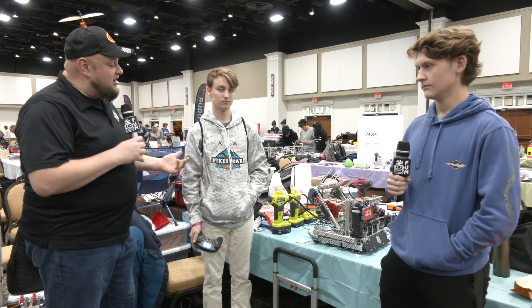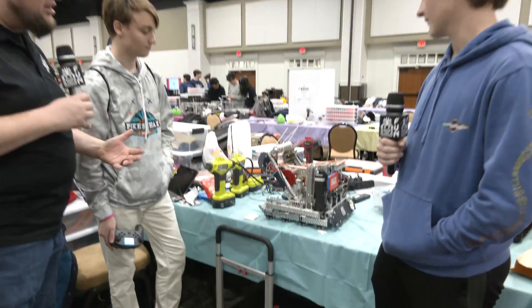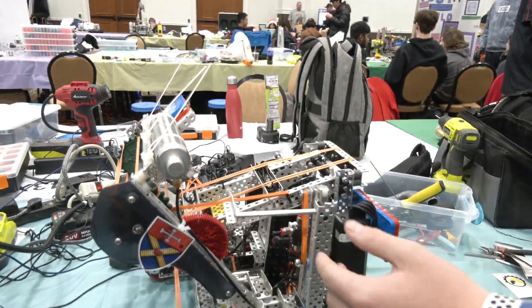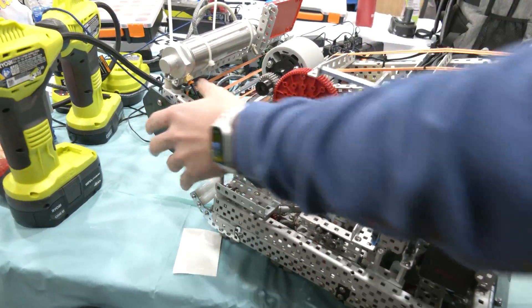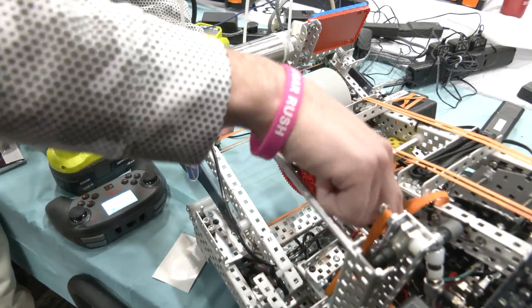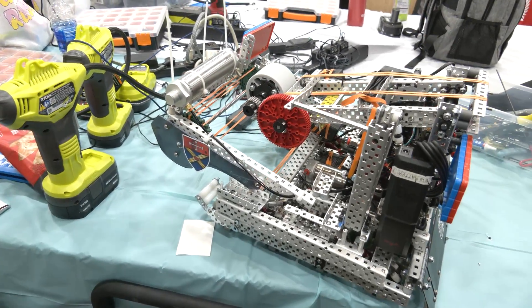Nathan, let's talk about your robot. You've got an intake that went through a couple of iterations in the rebuild, and also a double hang. So our intake starts up like this so we can stay in size, and when it spins it just drops. There's a little stanchion inside attached to one of our bearing blocks, and the rubber band just hangs on that — when it comes off, it just falls down. Works every time, helps us keep in size.